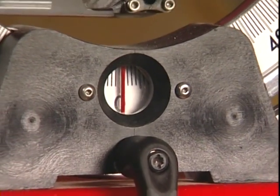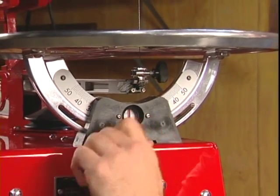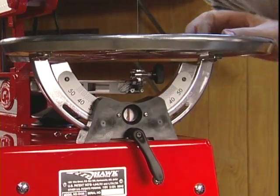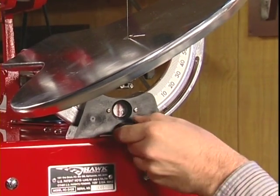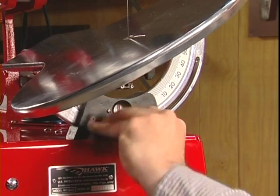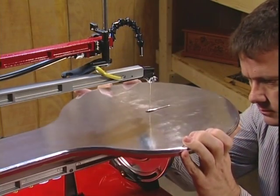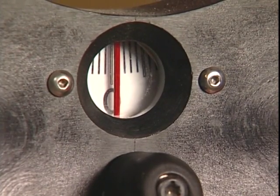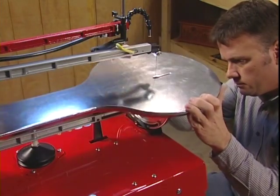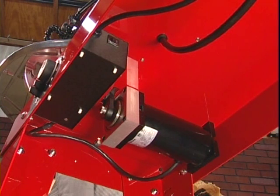With the two-way tilting table, you'll find that's important to create all kinds of projects. It might seem like a small feature unless you've experienced the limitations of a traditional scroll saw. Since most scroll saws mount their motor on top of the base, the table will only tilt with full movement to one side. With the Hawk, you simply set your table using the easy-to-read vernier gauge on the front and make your cut. You're only limited by your imagination, not by your tools. And there's common sense involved in mounting the motor and electrical components under the base and away from damaging sawdust.